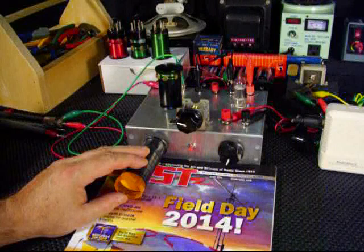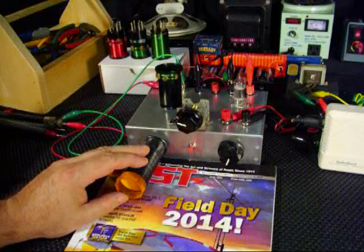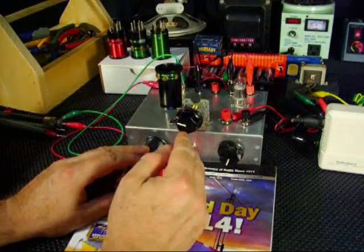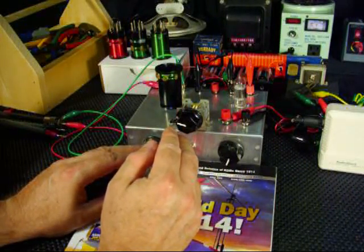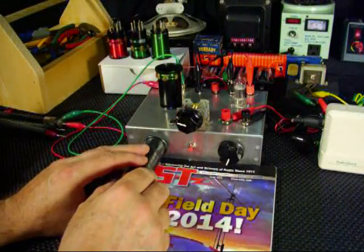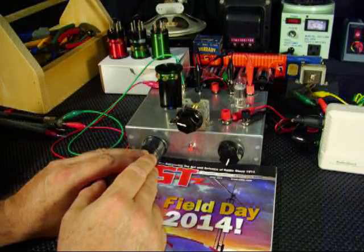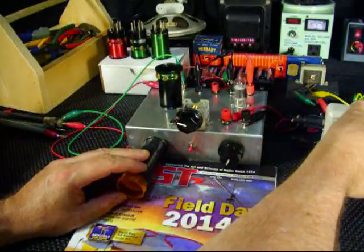You'll see that this radio is amazingly selective and sensitive, although it is prone to picking up kind of a wide bandwidth. So if there's a strong station nearby, it's going to swamp over the station I'm listening to. Once you get your frequency set with the tuning capacitor, it's almost like it chooses the section of the band you want to monitor. Then you work between the fine-tuning or antenna tuner and the regenerative control to tune it in, and of course you may have to adjust the volume.